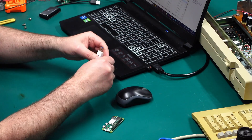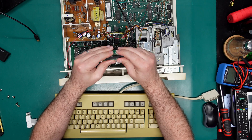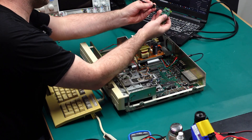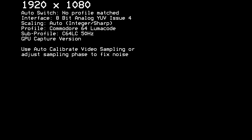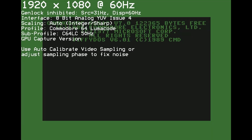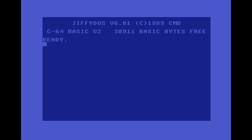With the SD card done, we can stick it back in the Raspberry Pi, plug the RGB to HDMI in, make sure it's connected to the computer, plug in the HDMI output, and give this thing some power. We can see the little info screen from the Raspberry Pi, then we turn the machine on. Wait for that to disappear and there we go — pixel-perfect HDMI from a Commodore 128, completely jail-bar free finally. As far as I can tell there is basically zero lag, and of course if we do the thing that every Commodore 128 owner did — type GO64 — everything looks perfect.